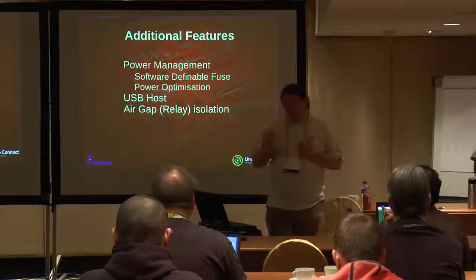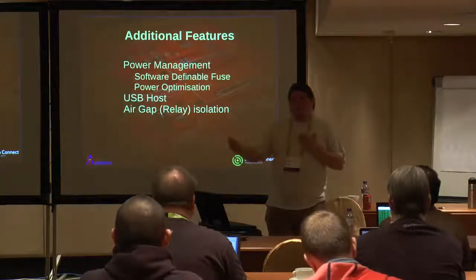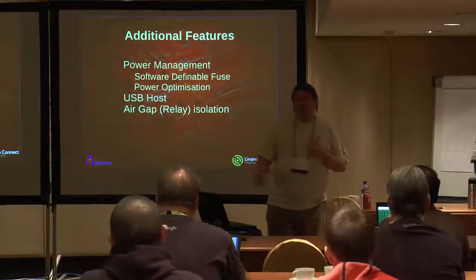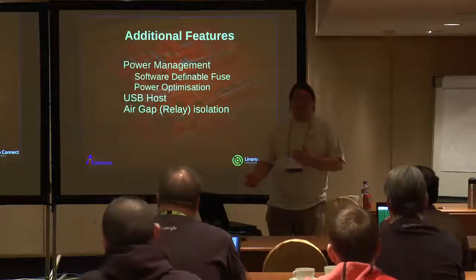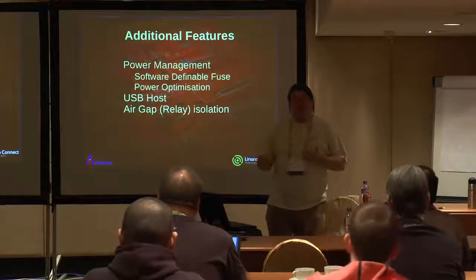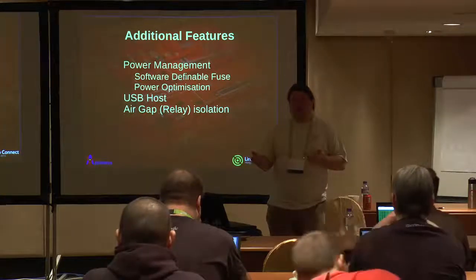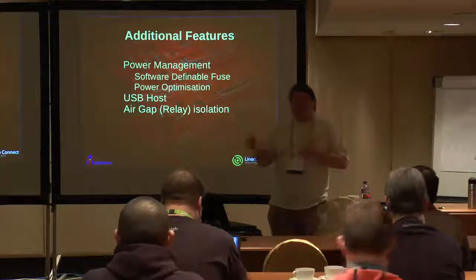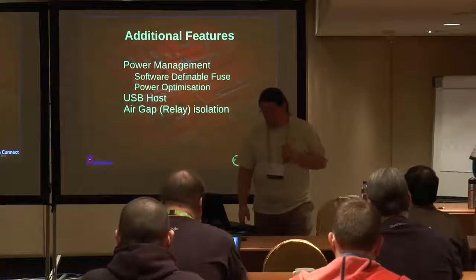Also turns out, as we're doing this, we've said we're going to need USB as our power supply, or effectively we can now also give you USB host as well as your serial console. It's just another channel on the USB. Then we added an additional USB hub into the design, but it didn't really add much in the line of cost.